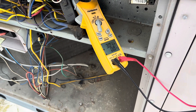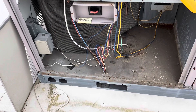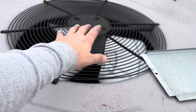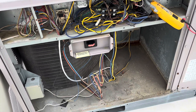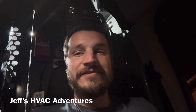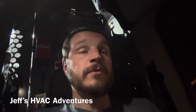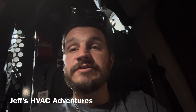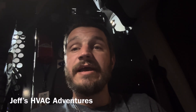The pulley's tight, everything's in line, we're good to go. This is a straight air conditioner so it probably won't run much, but we might bump it and make sure the compressor runs. It is discharging warm air, so I know it works. When they need to use this air conditioner it'll be ready to rock and roll. Somebody had a three-phase motor on their truck, realized the original was bad, and wired it in — probably would have worked longer if they weren't just breaking one leg of power. We ordered the correct single-phase motor, put it in, and got it back up and running. That's gonna be it for this one — go ahead and like the video, and if you're new here don't forget to subscribe.